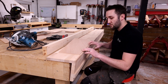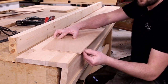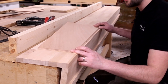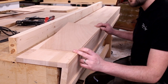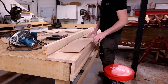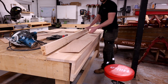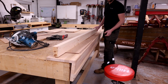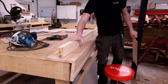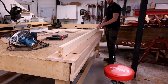To cut the scarf, line the plywood up with the forward face of the jig or slightly back. Moving the plywood further back from the front face will thicken the feathered forward edge. If you're unsure how the cut is going to come out, start further away from the blade and slowly move the board forward with consecutive cuts. Because I'm cutting quite a short piece of plywood here, I'll put another piece further down the jig to help balance the top clamp board and ensure the plywood is held flat to take out that twist.